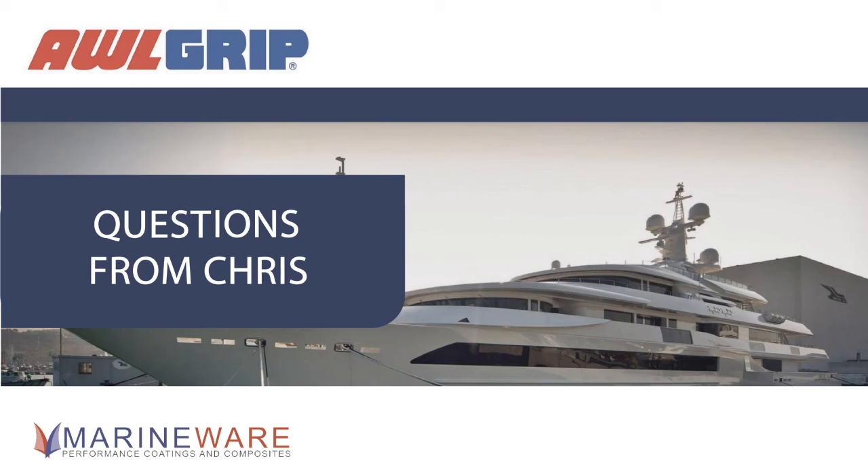Rich is going to love both of these questions. The first one: as you said, the FL is a little bit more flexible — would this make it better for use on wooden boats, which move a lot? Well, the flexibility and the strength lend themselves to those sorts of substrates — GRP that maybe moves after a period of time or becomes soft over years. Repairing with FL would be a really good opportunity. For substrates that are a little less stable, where you need a bit of flexibility but some strength as well, it could be a good fit. Probably need to do some trials on that.